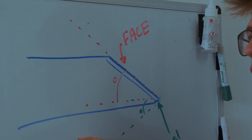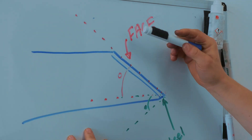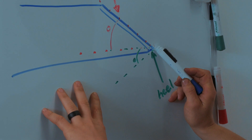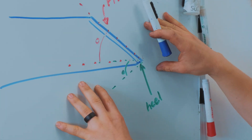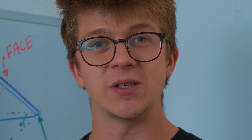I know nothing. I'm a complete, rank, awful amateur. But an engraving tool has these key geometries. It has a face angle, which is the front face of the cutting tool. And then it has a heel angle, which is a very slight 10 to 15 degree relief on the underside of the tool, upon which the graver rides through the material. The angles of them both are extremely critical, and without properly sharpened tools with the correct geometry, there's absolutely no way I'll be able to carve this design.